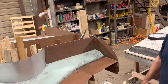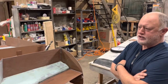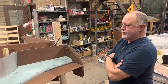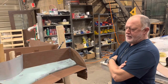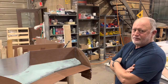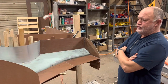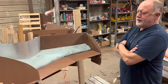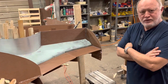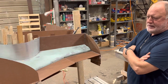And then next week — today's the 20th — so the plan is to get the first skin down Monday. And then from there on, we'll do a skin a day until we're finished with the laminate buildup. Four layers on this one, because it's not a full production mold, it's a limited production — so we'll do four layers and a woven roving. Then we'll put our metal frame on, get this rolled over, take these flanges off, and start the next mold.